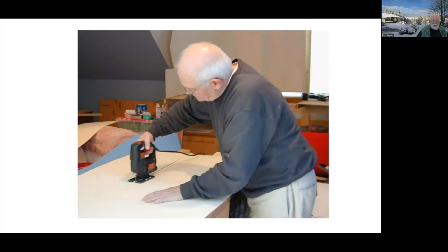I'm not sure whether a couple of the others, local ones like Dunn and others, handle it. It's not cheap, but any plywood right now is not cheap. But the thing is, it's easily cut. Like I say, it's an eighth of an inch thick, and it cuts very smooth with very little chip out. Or you can put it on a hard surface and cut it with a taping knife. And you can also use it as substructure for buildings and that sort of thing.